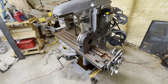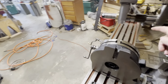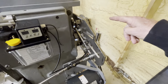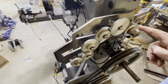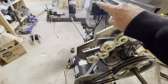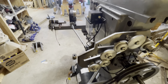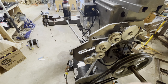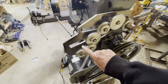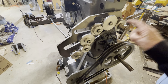The way this works is that in order to coordinate the motion of the gear blank with the hob, it requires an index train on the back of the machine. Right now this index train is set up to produce 40 revolutions of the spindle for every one revolution of the turntable mounted to the bed, which allows me to make a 40-tooth gear. Changing the number of gear teeth is simply a matter of changing the gears in this index train.